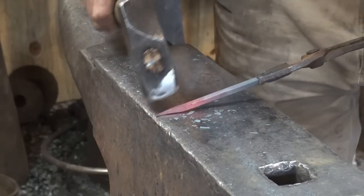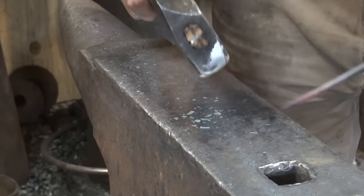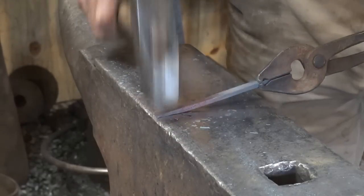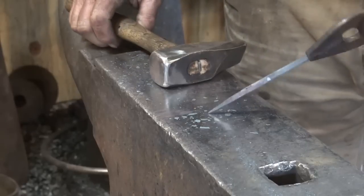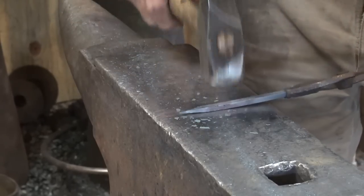Notice I'm drawing out at the edge of the anvil so that my hammer kind of overhangs the anvil. That way, when I get to this tip, I'm not bouncing my hammer off the anvil — I'm forging the end of the hook. That's a fairly simple one-heat taper. If you need two or three heats, feel free. No big deal at all.